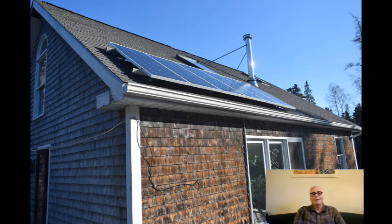I opted to use these relatively small panels — smaller than you usually find in a roof-mount solar array — because there are no dealers that sell solar panels in this area. I live kind of out in the sticks, so I would have to have any solar panels shipped to me. The larger panels, say 250 or 300 watt panels, are too big to ship by UPS, so they would have to come by truck freight, which would be quite expensive — probably as much or maybe even more than the panels cost.